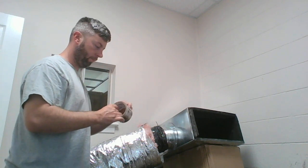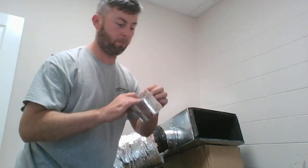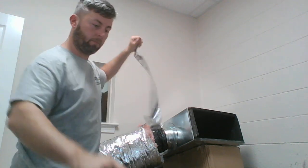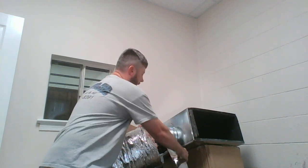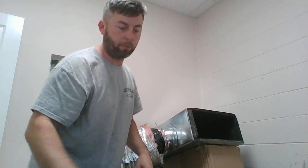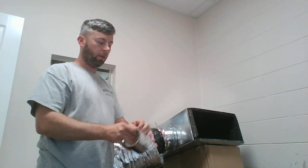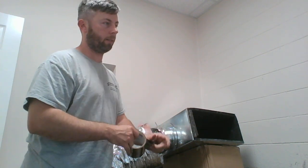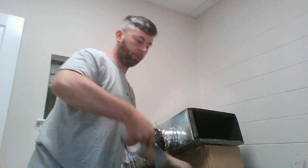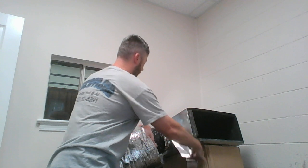Take you some tape. Take you some more tape. Run your strip out, and run you a good round around that. This is that, again, like I said before, some municipalities, some ordinances, some cities, some states require you to use the large nylon zip tie to wrap around these things. So you may want to consider investing in one of those tools. Two rounds around that.